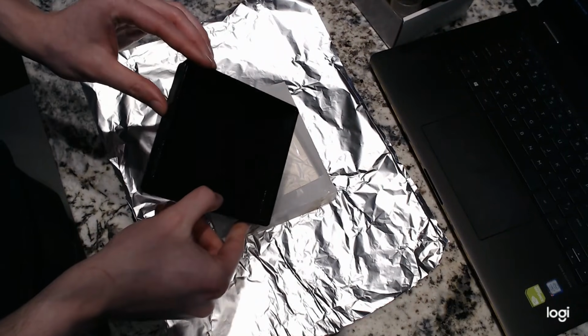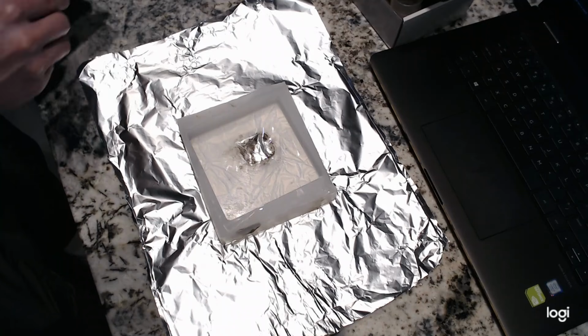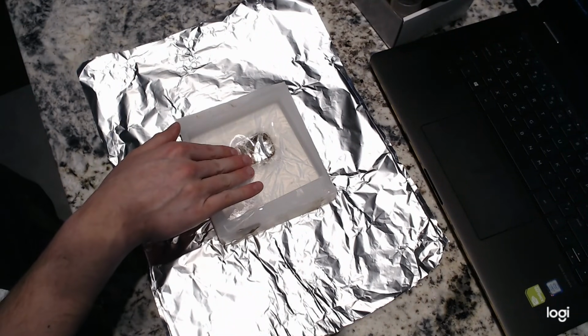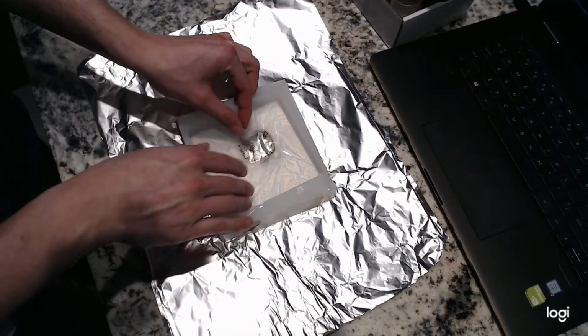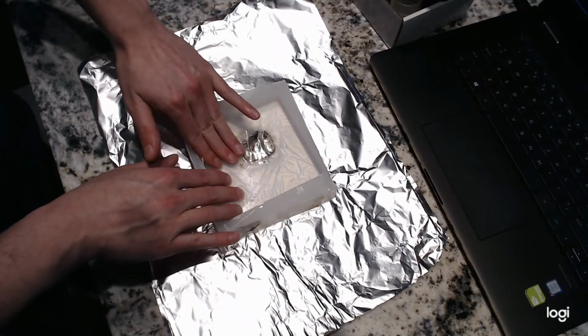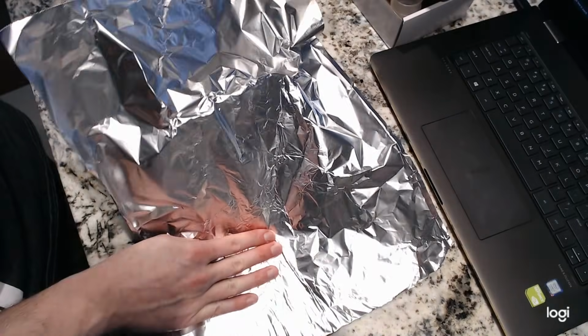After printing this shell, I used a silicone molding kit, which I'll link in the description, to mix and pour liquid silicone around the shell. This usually takes about 12 hours to fully dry before the mold's created. Unfortunately, the shell kept floating up with the liquid silicone while it was drying, so I had to hold it down with an old processor cooler, creating this hole in the mold.